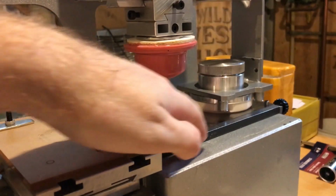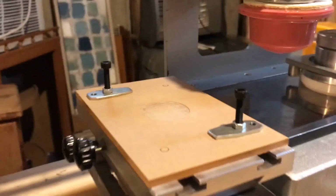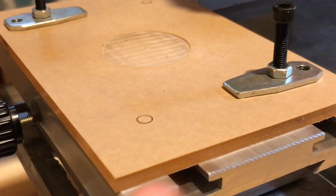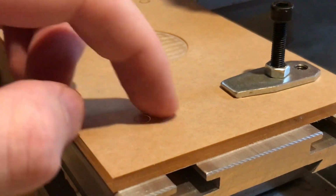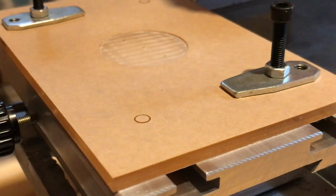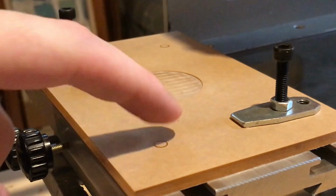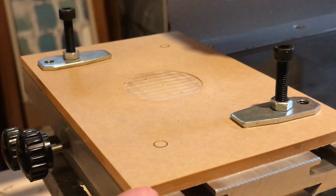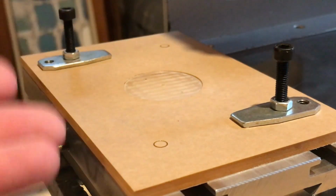So we have the plate, we have the ink, we have the pad, and then we have what's commonly called a fixture. Again, these I get custom made locally here for me, and this is a piece of acrylic. So this is plastic, which again has been laser etched. You can see there are circle cutouts here, and I've had this done on the four corners so I can put the bolts to hold this thing in place on whichever corners I want, given my setup for this particular printing. This is a piece of plastic. It's basically the same width as the surface for the plate.